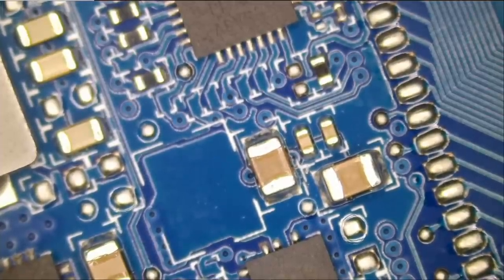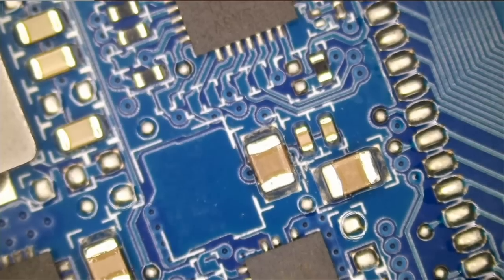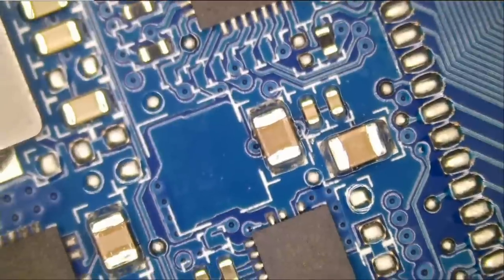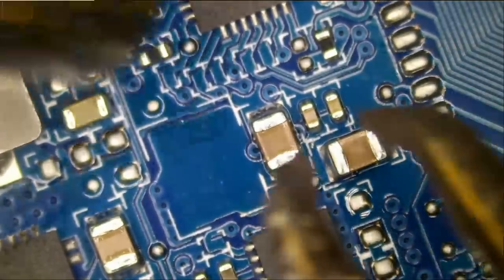One of the two. We can start with the capacitors. Since we only have two caps, it's easy to remove them one by one. If we had 10 or 20 caps here, I would use the atomizer and apply some flux powder to see what melts first. But right now we only have two caps. I'm going to use my hot tweezers along with hot air — those are big caps and hot air will make it a lot easier. I can do it with hot tweezers only, but to speed up the process, let's do both.